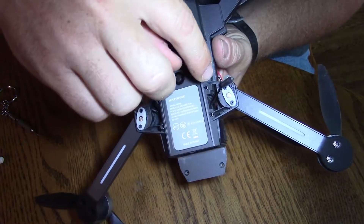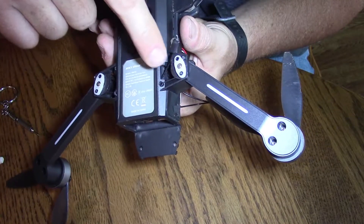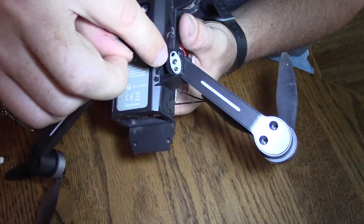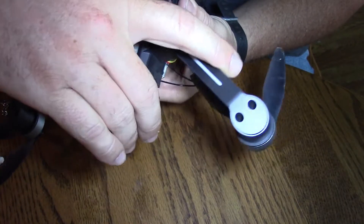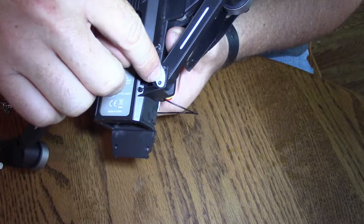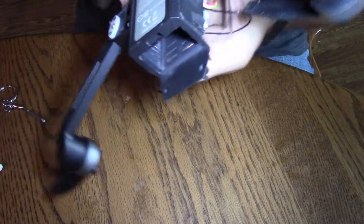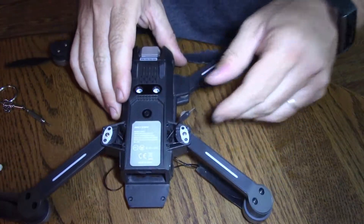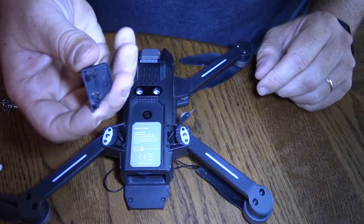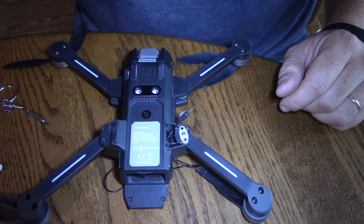We have connected the arms to the body. This is a spring-loaded piece that fits into a square hole in the arm, which goes through the body. I found out that you have to have it retracted all the way, put it in, twist it slightly to preload it, push it down, and then it snaps in place. Now I need to screw those into place — pretty self-explanatory. They just fit in the corresponding holes and go down, and then we put in two screws.